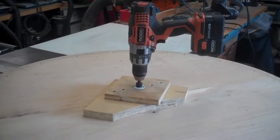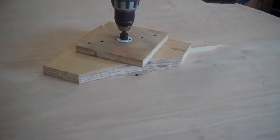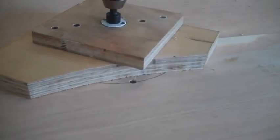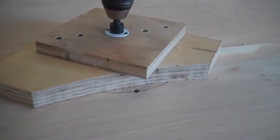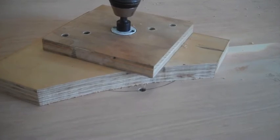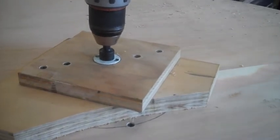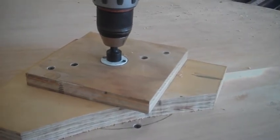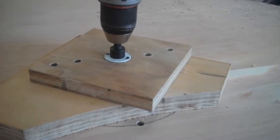Right, what we're doing now is I have to get a 1¼ inch hole straight down through 1¾ inches worth of plywood. So I used this scrap plywood and made a jig. I drilled those in using the milling machine so I know they're straight. And then you saw me cut down the teething off the outside of the hole saw. Then of course I didn't realize, but there's a fairly good weld holding the saw to the arbor itself, so I had to chuck that in the lathe and turn that off. So now, in theory, this should bore a straight hole down through.